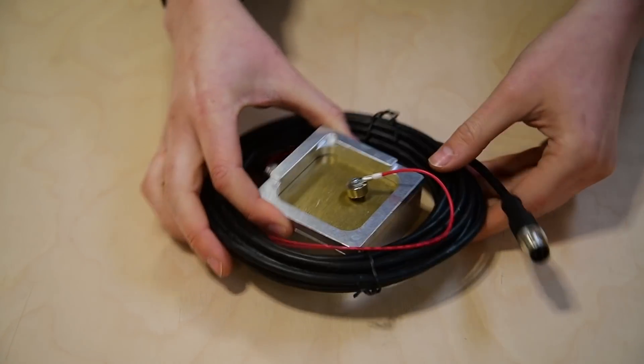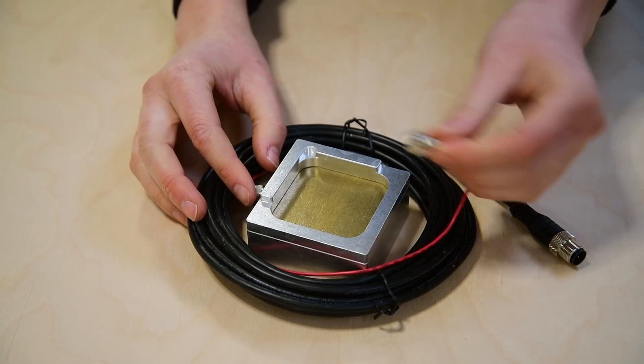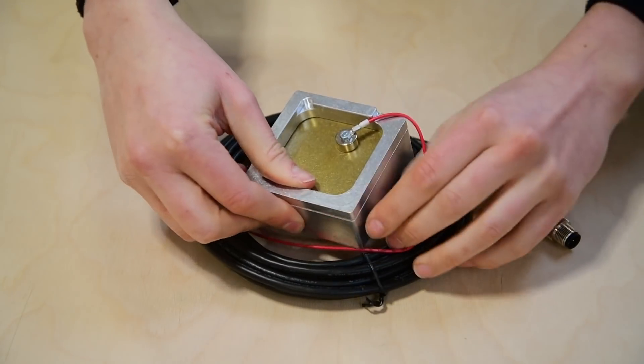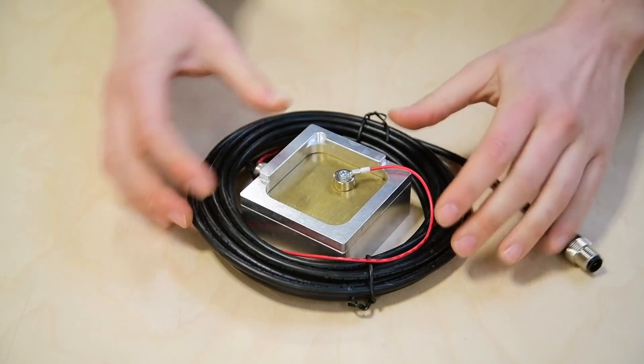This is a tool that allows for quick and precise settings of your tool height and workpiece corner edge location. It is dual-sided for Z only or XYZ finding. It has a spring-loaded brass plate safety feature, quick connecting magnet, and corner finding wall.